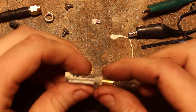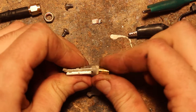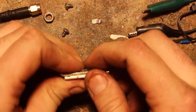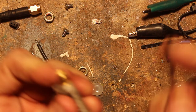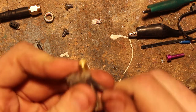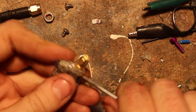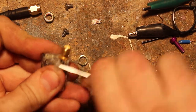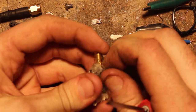So first thing — you can see this one after a couple of crashes on the weekend, the connector is loose on the board. You can see I've reinforced it with hot glue to try and make it a bit stronger, but it didn't work. I prefer to use hot glue for things like this rather than epoxy, because you can sort of peel it off and fix it up later, whereas once the epoxy is on there it's a lot harder to undo.